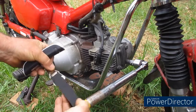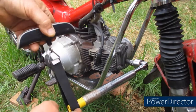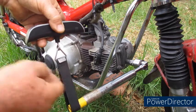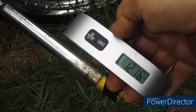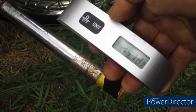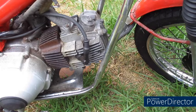We need to pull on that at an angle of 90 degrees and exert a force of 15 pounds. So if you can see that — 12, 13, 14, 15 foot pounds. I've gone around all the nuts diagonally as best as possible, torquing them down to 15 foot pounds according to my luggage scale.